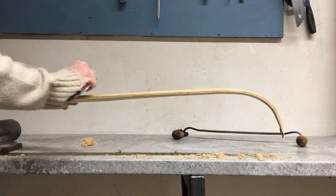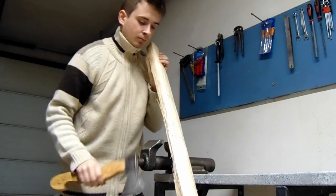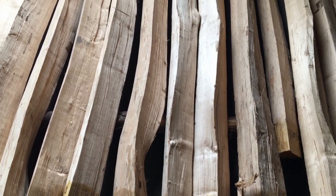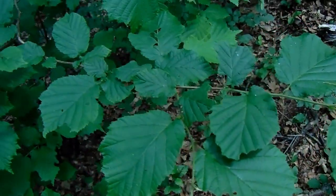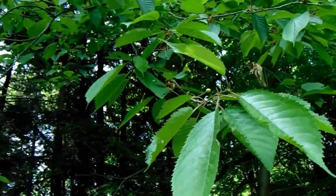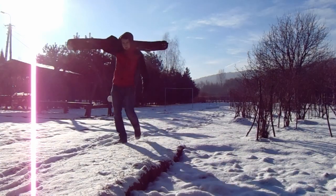Of course, some are more suitable than others, but in the beginning of your bow making journey, the most important thing for you is to gain experience and learn the process. It would be a shame to break a precious yew stave, which is by the way far more challenging to work with than woods you can probably find nearby. So look around and see what you can get. Most of the hardwoods are decent material. It's worth visiting a local hardware store. Some boards like hickory, oak or maple can be useful too. Remember, you can make a great bow out of many wood species.